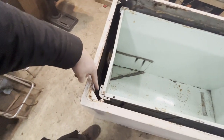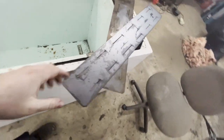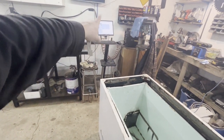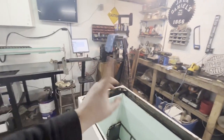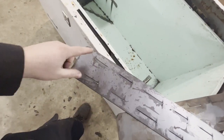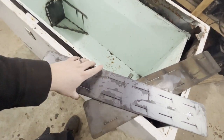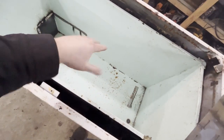What I need to do is lift this tub up because it meshes with these brackets right here and it's about two and a half inches down. So I got creative with the plasma cutter and made these custom pieces. I used the MyCAD system that comes with the MyPlasm software - I was able to design it right on the computer and cut it; took me 10 minutes. These are all bend lines - I'm going to bend them up to make a little steel stud. These two studs will just lift it off and give me something to screw to.